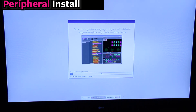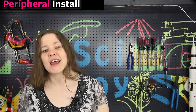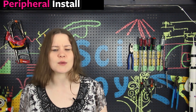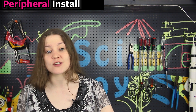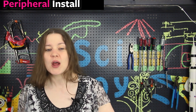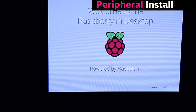There are different versions of Raspbian out there — Stretch, Jessie, Wheezy, and others. If you're having problems installing a library or using a program, check what version of Raspbian you're using and whether it's supported by that library. That's just for troubleshooting in the future. Once Raspbian is installed it will ask you to reboot, and after that it will bring you to the Raspberry Pi desktop.